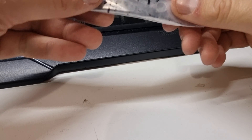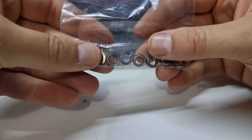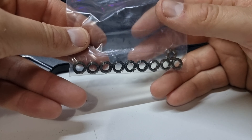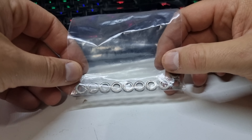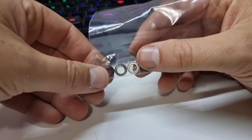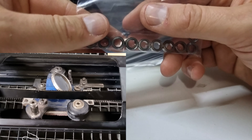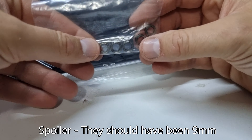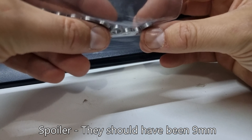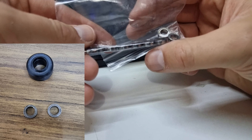We're back for a job, but it's a lockdown job. Of all the things that can stop a business operating, some little tiny bearings. Today we're going to be looking at a mate's laser cutter. He can't finish business or do a lot of what he needs to do without this laser cutter running. A couple of the main carriage bearings have dropped off. Basically, one of these little MR 10-6 double-Z bearings — 10mm outer, 6mm inner, 3mm thick, shielded — disintegrated, so we're going to replace all of them.